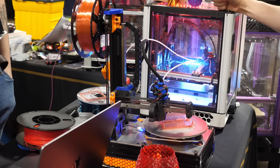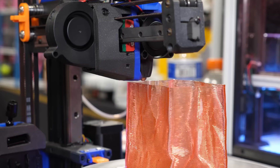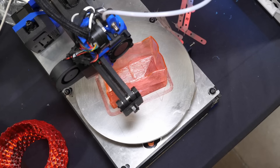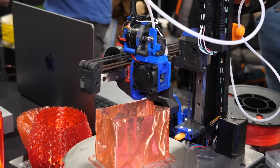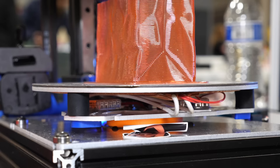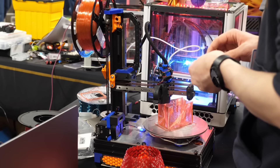One of the biggest challenges was firmware, where they invested quite some brain power. Standard Klipper doesn't support polar printers with a rotational axis — RepRap firmware would have been an option — but they went all in and modified Klipper for these kinematics, covering all edge cases and working with a combination of angles and cartesian coordinates to get smooth print moves and even mesh bed leveling working. It's a beautiful machine, and beyond the small size these kinematics might be interesting for multi-axis printing. By adding a fourth tilt axis to the print head, you'd also get a fake fifth axis, because the polar axis of the bed would let you reach places unreachable on a cartesian printer with just a single tilt axis. The files for the P-REX-Z and the Klipper fork can be found on the Armchair Engineering GitHub.